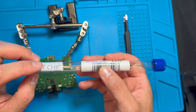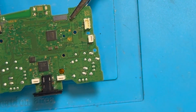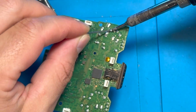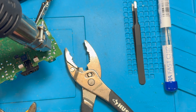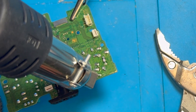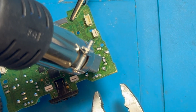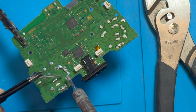What works for me to remove the joysticks is this fast chip SMD removal alloy. It comes like this — you just want to melt a little bit and put it on the pins. Then we melt it with the heat gun and that releases the joysticks from the motherboard. I'm going to get my heat gun going to around 800 degrees. As soon as I see the SMD is melting I'm going to pull out the joystick. You saw how easy it just came right out. All the stuff I'm using I'll leave in the description.